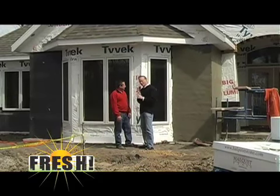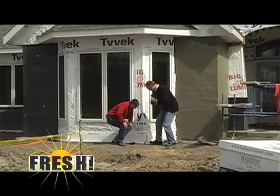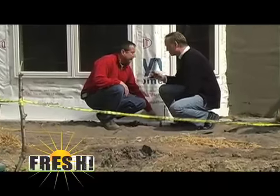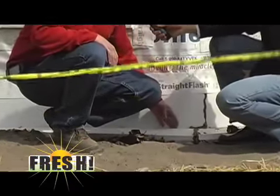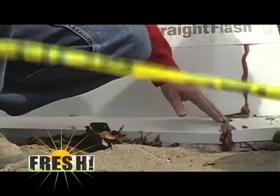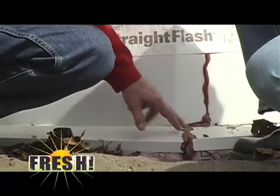And so what you're doing here, and we'll drop down here just to take a look, down on the flashing, you're very careful here to make sure that even the seam of the flashing is sealed properly. Yes, that's correct. We have metal flashing here that we've bent, so there's no seams, comes down, goes over the foundation, and then where the butt joints are, we do have a butyl sealer there that's sealing that up.